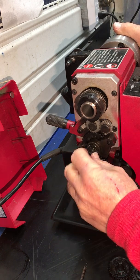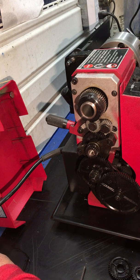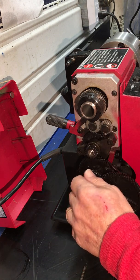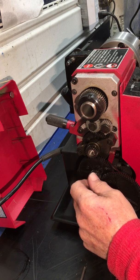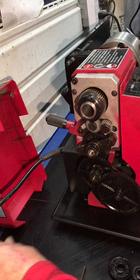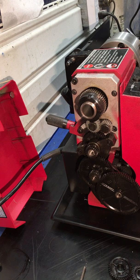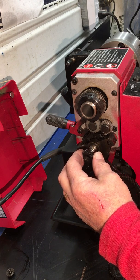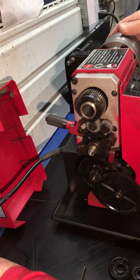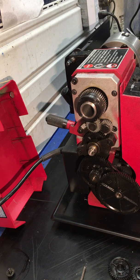The lathe is turned off and unplugged. I got an area of my bench here designated A, B, C, and D. The owner's manual tells you what gears go in what order to get back to the original configuration. First we're going to remove A — it comes off quite easily. Be careful that the key stays in place. Now to take C and D off, let me grab a paper towel.